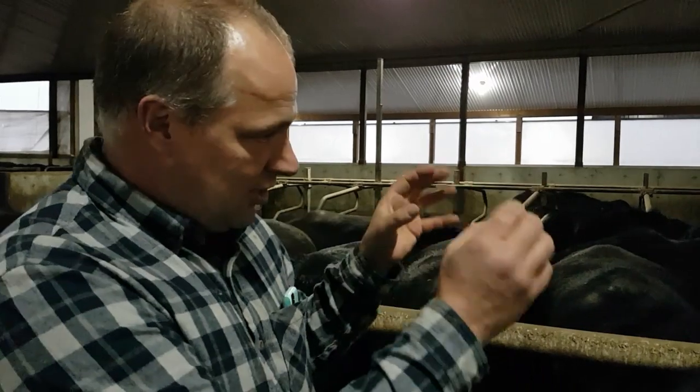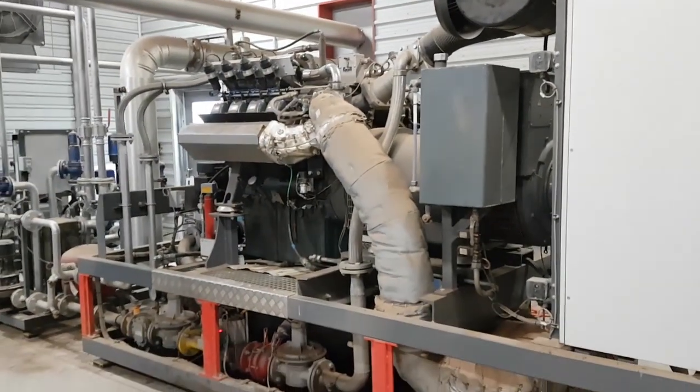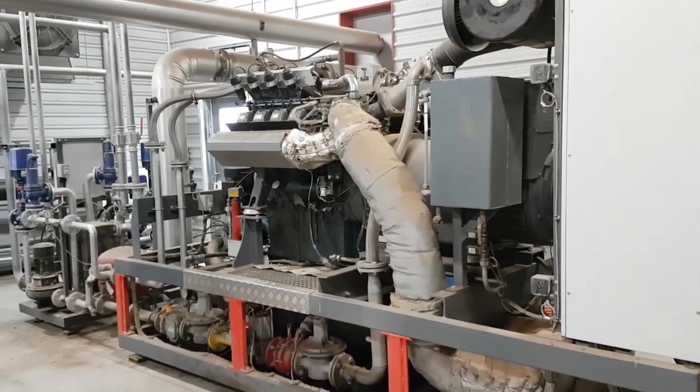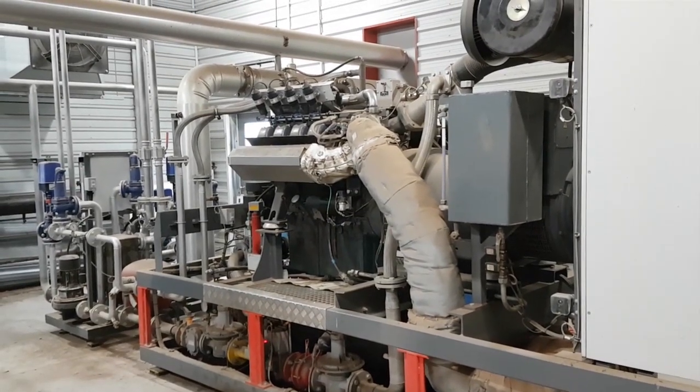Methane is one of the gases I'm producing with the manure from the buffaloes, as well as some of the waste and some of the green garbage that comes out of many houses in the city. They sort their garbage, we'll take that. With the compost too, we mix it all back in, and we put it in this vessel for 20 to 40 days, harvest all the natural gas off it. We run an engine and make electricity.